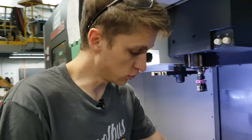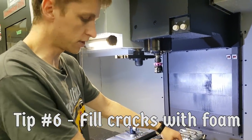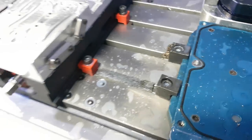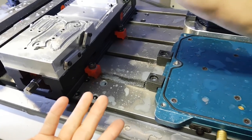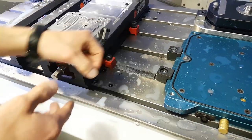Ancelot had the great idea to use these little bits of Kaizen foam between all the T-slots — the parts where chips used to just get stuck all the time. Here they can be flushed underneath, but there were sections where they would just never come out. It's been great because now the chips don't get stuck in there.